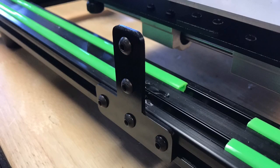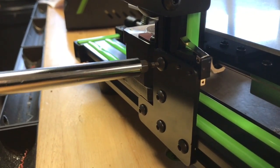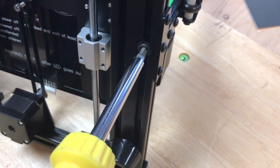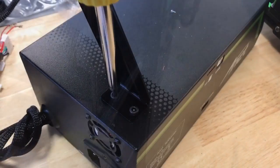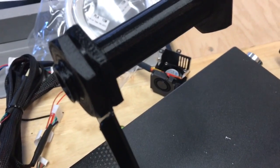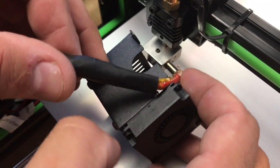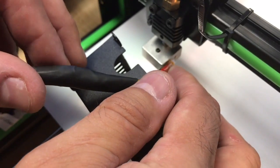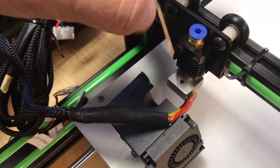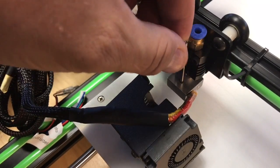Now I was ready to assemble. It already had the T-brackets installed with T-nuts. I just had to slide down the assembly onto those T-nuts and then tighten them up, but I had to back them off and wiggle them to get those things to turn — it took me like five tries. Then I installed the screw on the bottom; this should have been first, then the T-brackets, but they had us assemble it this way. I installed the bracket for the spool holder — that just screwed to the top of the power supply — and then there was a 3D-printed spool holder with 3D-printed nuts, and that tightened up fine. The heat element slid into the hot-end block and you just push the temperature sensor into a hole, but there's no screw to hold it in place — so you've got to hope it's making good contact. There is one set screw to hold the heat element in place.